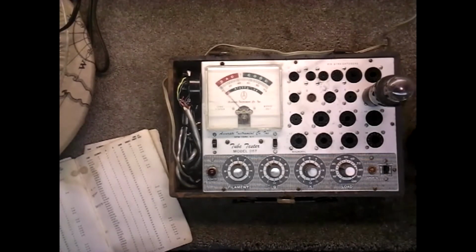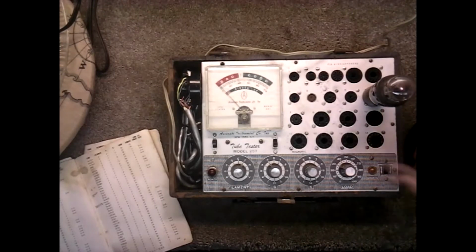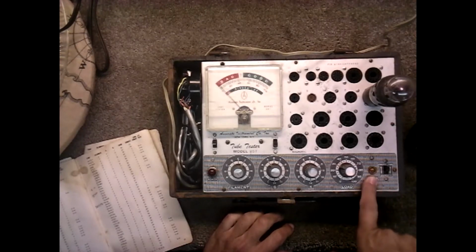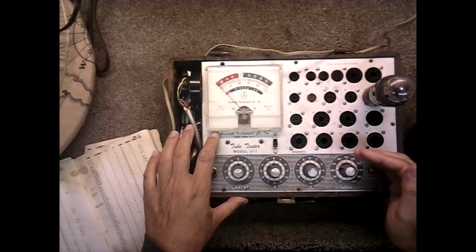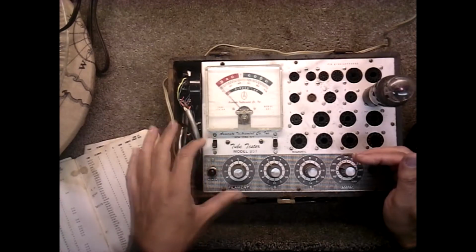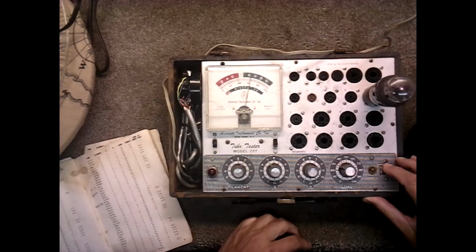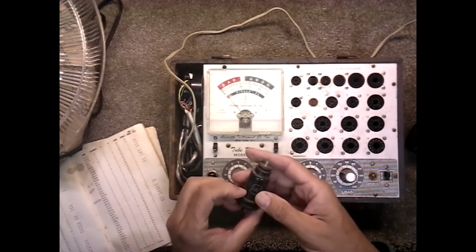Okay, there's not many tubes in this radio I can check. This one is the 25L6 output tube, audio output, and you see it's got a short. So I'm not going to worry about that too much right now. It is lighting up, and it's testing borderline good. Well, it's testing good. It's okay. I can't check that unless I know what the cross for it is.